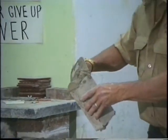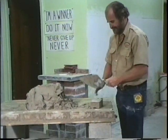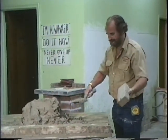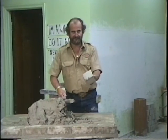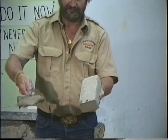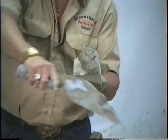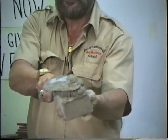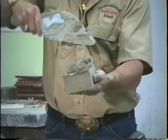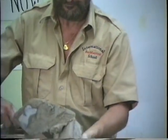All right. And while you're here, break up the monotony. Let's go ahead and practice once again how to do a soldier or a roll lock. Hold the trowel away from you, like this. Get it all off. Take it and bring it down. Still got it on your trowel. Bring it down. That is a full head joint. Do it again.